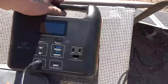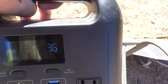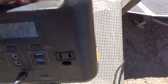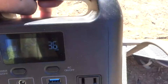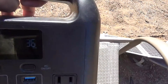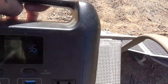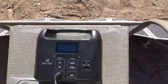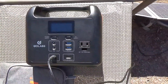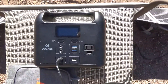Okay, we've got the 60-watt set up — you can see there are six panels. Let's see what we're getting on the display. You can see we are getting 36 watts, so about nine more watts over the 40-watt panel. Which would be the better buy? Let's go back inside and talk about this a little bit more.